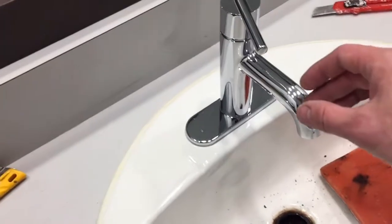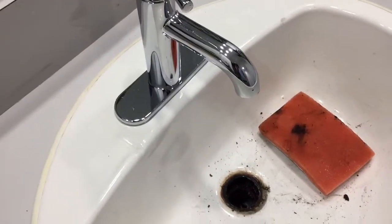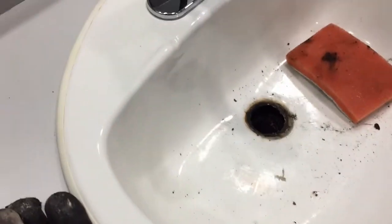I installed the new faucet, which was a little tricky, but with the faucet comes a new strainer, so I wanted to install that. I had to actually lift the sink up to get the strainer in, and I cleaned around it, which was disgusting. But I saved the best for last — down here I've been cleaning out the overflow, which is this thing here. Basically, if the sink level comes up too high, water comes in here. Let me see if you can guess what the previous owners did.